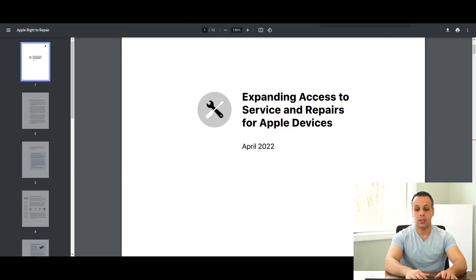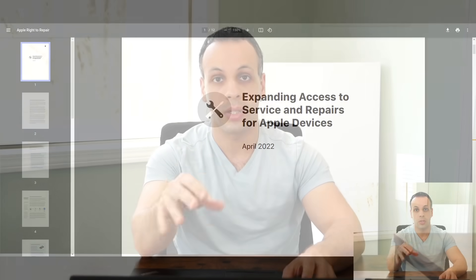I don't understand why there was the need to include that in their document. Not only are they saying upfront, 'We're not going to include schematics, board views, or diagrams so that people like me can do the job they've been doing for the past 10 years,' but they're also citing an industry trade association that doesn't do board repair to tell you why you are worse at board repair — making things up and gaslighting you by implying they are better at it, when there's more than enough proof from anybody who's opened an A1286 from 2011 that was refurbished by Apple that their BGA rework process is not particularly great. In my opinion, this is just a PR fluff piece, and I guarantee you will not see a single member of the tech press go through this document and point things out like this.